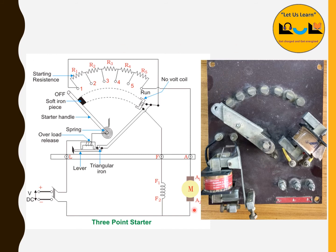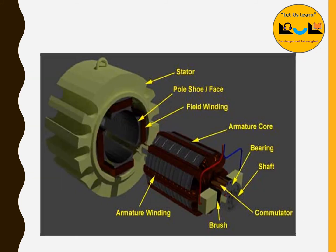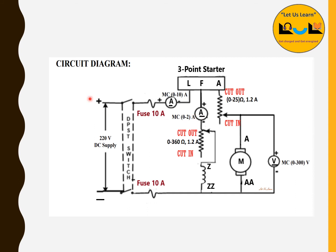Now we discuss the types of winding in a DC motor. As discussed, there is the field winding and the armature winding. Since it is called a DC shunt motor, the field winding and armature winding are connected in parallel with each other. The word 'shunt' means parallel or across. This is the structural diagram of a DC shunt motor.